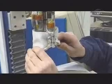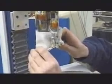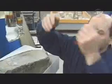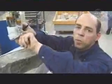Skirt tests were jammed into an already tight schedule. If we're grinding at an angle, then a lot of this dust that builds up as a crater along the rim of the ground area could build up inside the skirt if you're grinding sideways. It could all just fill in the bottom of the skirt. When you pull the RAT away from the rock to put an instrument on, where's that dust going to go? It could fall to the ground and plume up and potentially cause more problems than it solves.